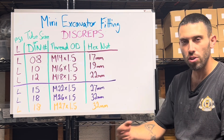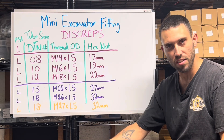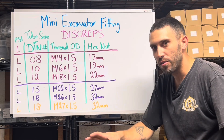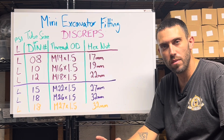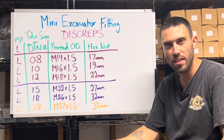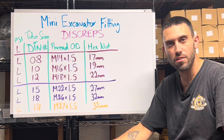When you're looking at a DIN fitting or your hoses, trying to figure out what size the thing is, there are really some categories they fall into. The first part is the series: high pressure, low pressure, signified with a letter — S, L, double L. Our machines use L series.